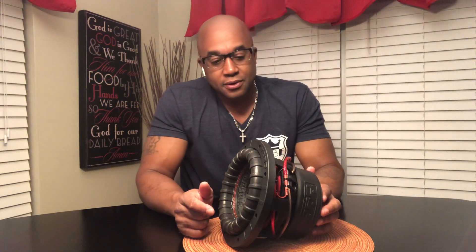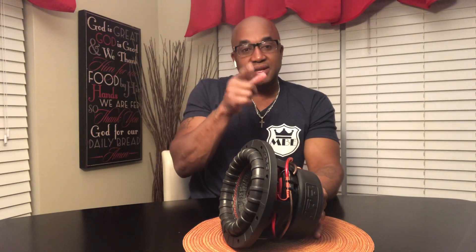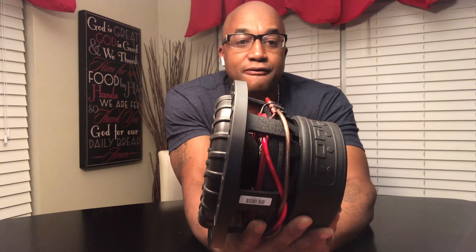Commonly used for SQ, aerial purposes, sound quality. A progressive spider — the ridges get increased in height and width as you move away from the voice coil, from the triple joint. The triple joint is where the cone — you see that little black line with that red and the cone — it's where the cone, the former, and the spider connect. That's why it's called a triple joint.